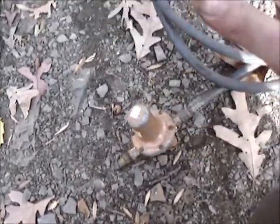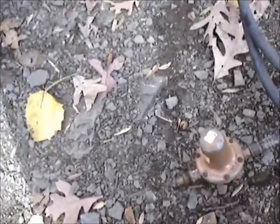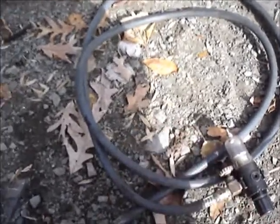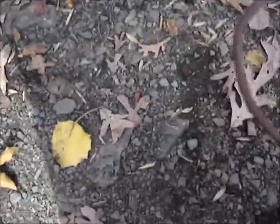As far as my fuel setup goes, I still have a regulator on back here coming off my 20-pound tank. I wasn't able to get rid of that, and I've heard people say get rid of the regulators — you're not gonna get enough. Well, I get enough, and I couldn't get rid of it if I wanted to because these two ends here are reverse thread. I could go buy something, but I like to do stuff with what I got on hand. It's not really hurting me — it runs.